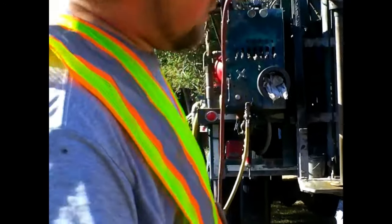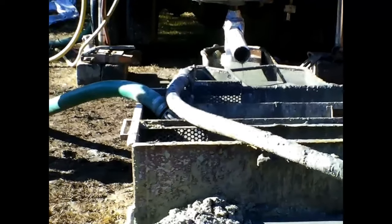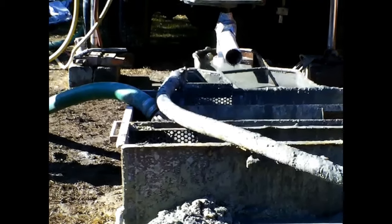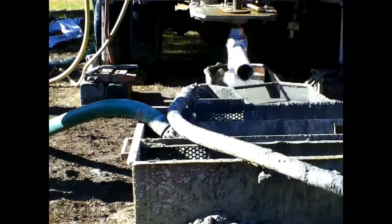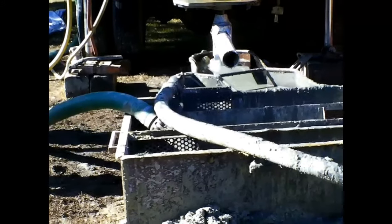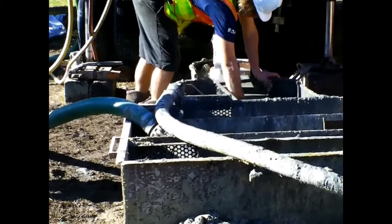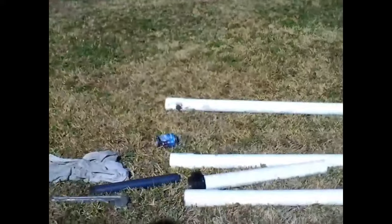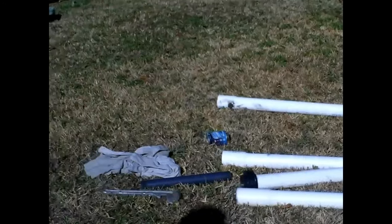That's groundwater. You know, we're pumping air in, doing an airlift procedure. And as you can see, it's making water, but it is going to have too much sand in it to get it open-ended. So I just wanted to test that real quick. Now I'll go ahead back to drilling a little more footage, conditioning the hole, and we will have to pull out and then set these number 10 screens out of the bottom of the 4-inch. Let them naturally gravel back, lock in.